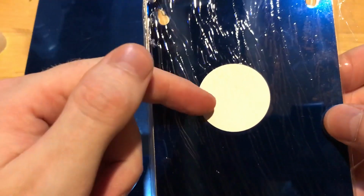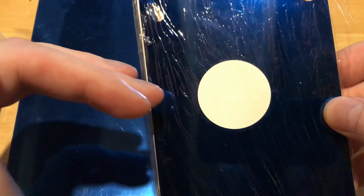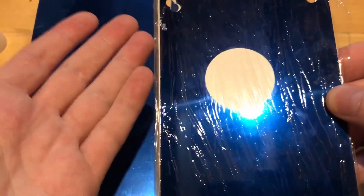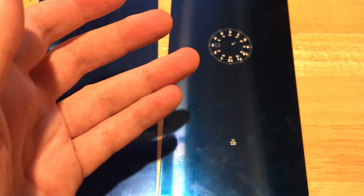And then here I actually have an etching for just the entire dial surface. That way, if I want to print the entire surface a base color, this will get filled with ink. The pad will come down on it, pick up the entire thing, and transfer it to whatever surface I'm printing the base color on. So just a couple examples of plates that have been etched, in this case with a laser, so that I can use my pad printer with them.